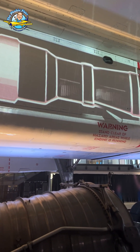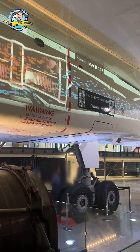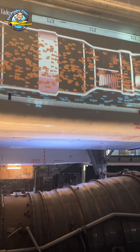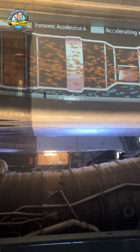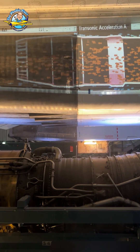So you have a compressor at the front — it doesn't look like that at all. It's a seven-stage compressor, and you have rotating and then static blades, then rotating, then static — seven lots of them on each of those. It looks as if everything's turning round, but it doesn't work like that. You have to have static stators in between.